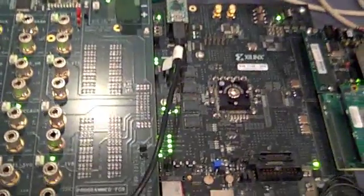So now you've got Linux running on it, what's the next development you're aiming to do? The next steps are really to build out the rest of the systems. If you noticed in my automation, the FPGA bitstream was loaded over JTAG — that needs to get updated so that it's loaded directly out of flash at boot time. We need to build out Linux support for the rest of the peripherals, or really just verify Linux support that we've already proven on the emulation for the rest of the peripherals, and keep expanding the set of things that have been tested and worked.